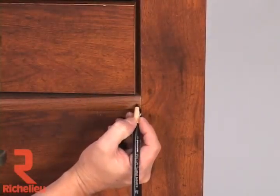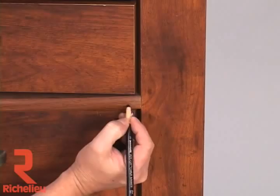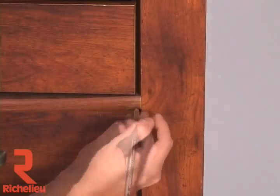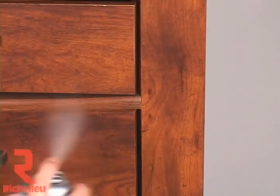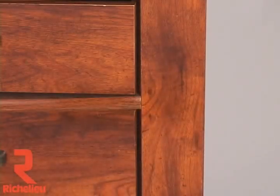Use the chosen pencil to draw back the grain as it would have been had there not been any damage. Rub lightly with your finger to feather out the lines if necessary. Lines made with shading pencils must be top coated in order to be permanent.